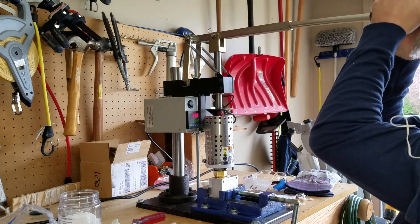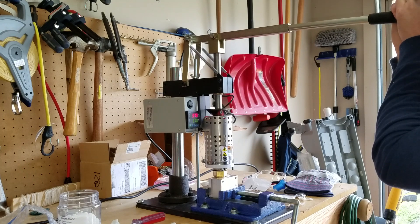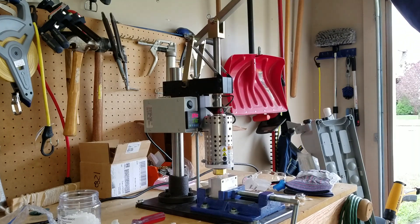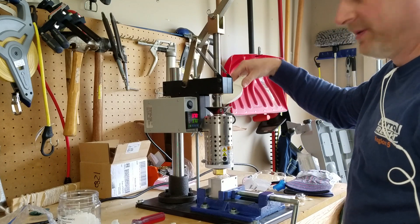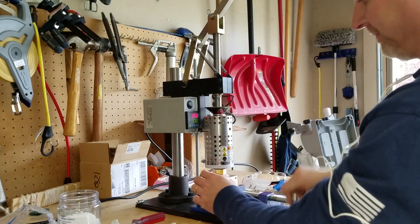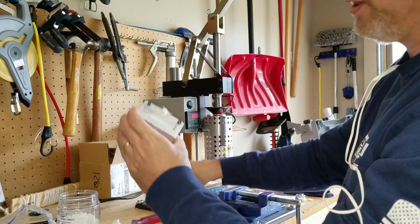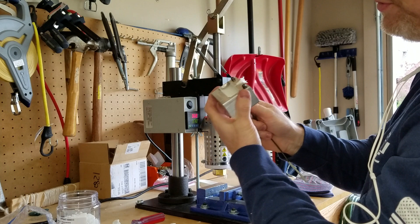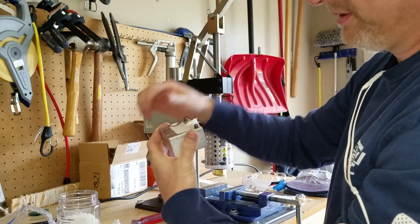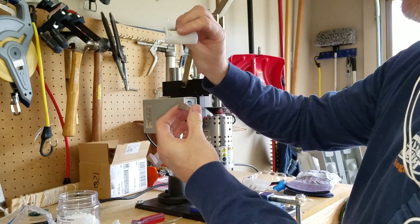Pull it until you feel resistance, give it a few seconds, keep the pressure on it just so it doesn't back out and cause shrinkage, let it go, fill the top, get it ready for the next one, unlock it. My particular mold has this insert in it right here — I have a hole in the back to push the insert up so you can get it out easy and it makes the perfect part.